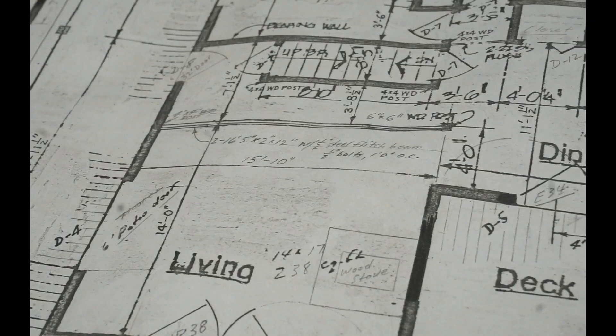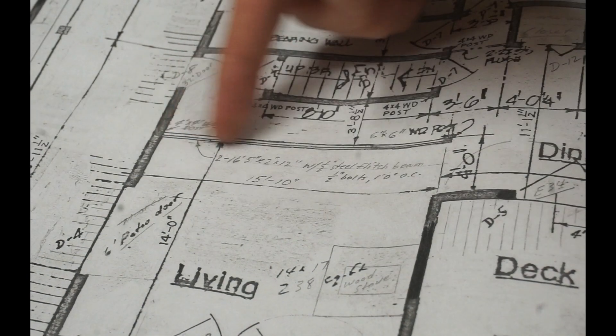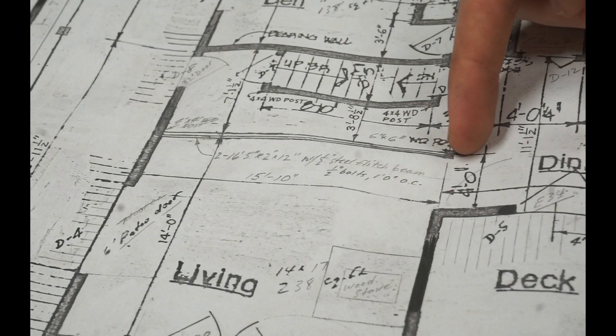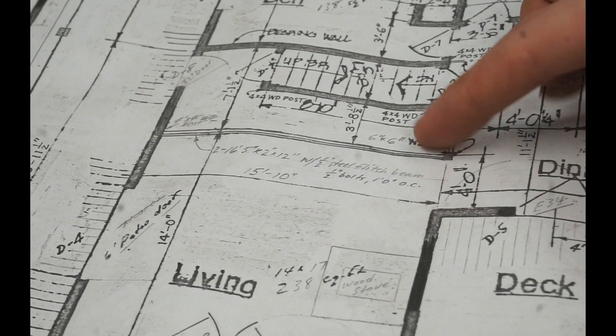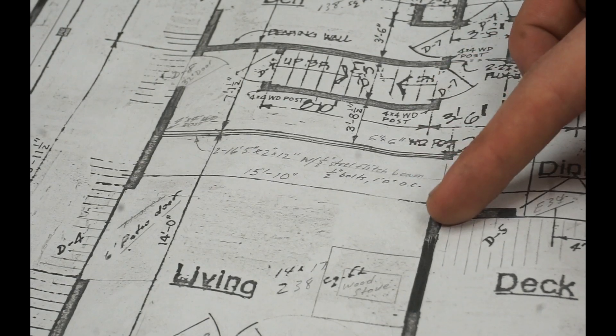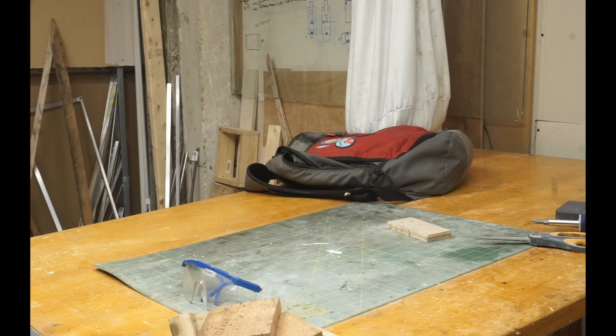Usually, a beam spans the distance between two posts. However, at least in the design for this house, there aren't really posts to span between. So instead, to work around this problem, the designers placed the main distance-spanning beam so that it started at the far wall, and on the other end had to intersect the second, larger beam, which then itself had posts to transfer the load down onto the first floor. And besides being a clever way to solve the problem, it adds an architectural feature to the room that looks pretty cool.